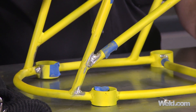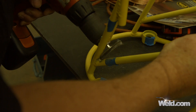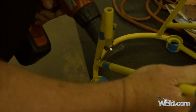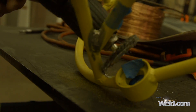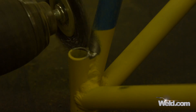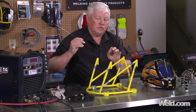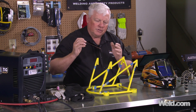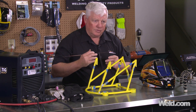So we're going to go ahead and fix all the sins, holes, pin holes, and lack of fusion. It's not going to take a long time, but this thing has been primered, so we did a wire brush to get the primer off. We're going to use ER80SD2 filler, and because this is pretty thin wall material, the diameter of this filler is only going to be .035. If you try to use 0.062 or anything heavy like that, all you're going to do is burn holes. You want a puddle started and then dab. So I'm going to get all my gear on and we're going to fix and repair all of this, and we'll show you the end result shortly.